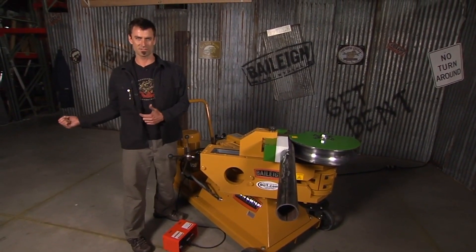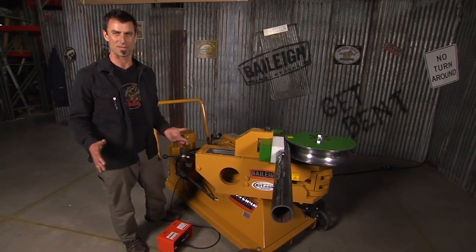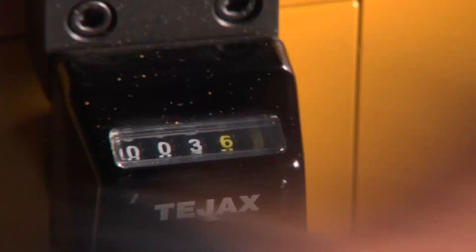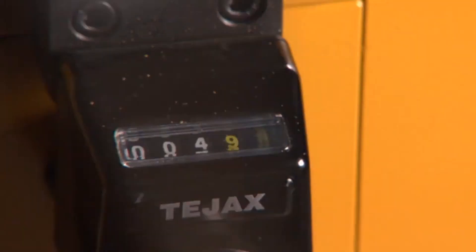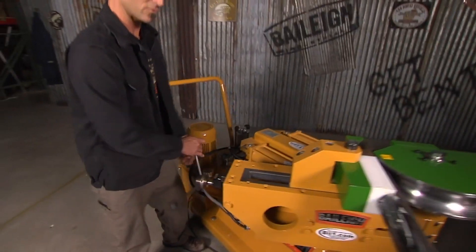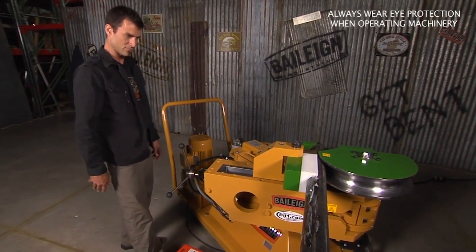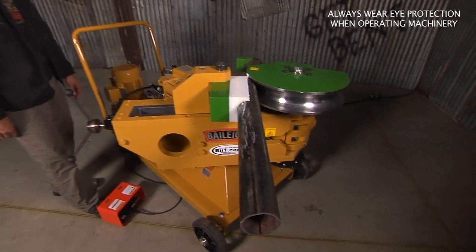It's really simple to use, just like the smaller ones — works almost the same, except it weighs 1,600 pounds. The way you set it in is just screw this in. You've got a little dial indicator so you can adjust how tight you want the die to be. We'll just snug it up for a test — look at that, wow, that's smooth! Serious tonnage to do that bend.